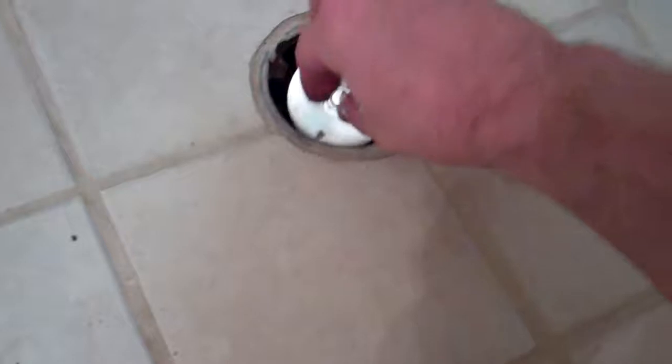So, step one, take your screwdriver and remove the grate over the drain right here. Set that aside, don't let your screws go down the drain. Okay, next you'll see I got a stack of pennies. I'll explain that one moment. I got a plug. This is a 2-inch plug I'm going to put down in the drain.